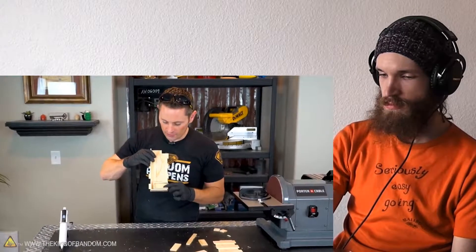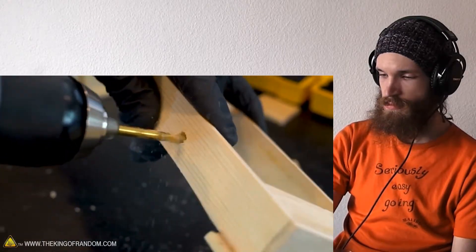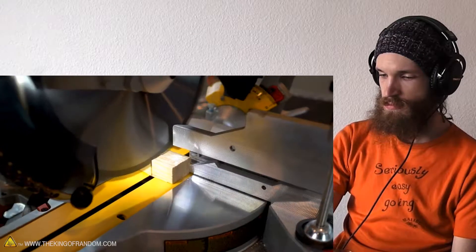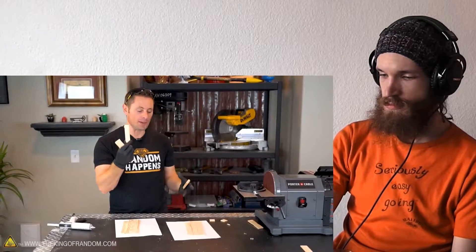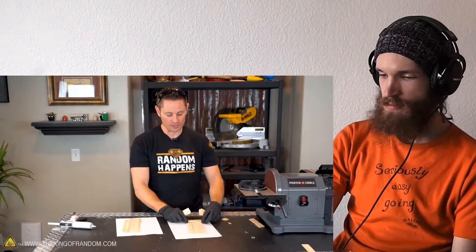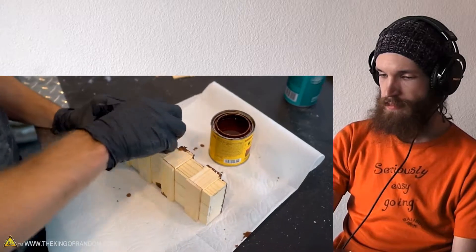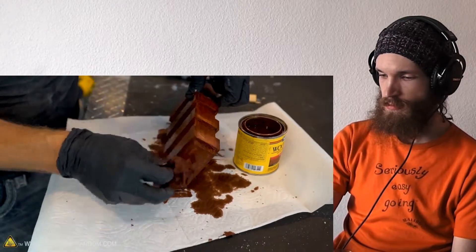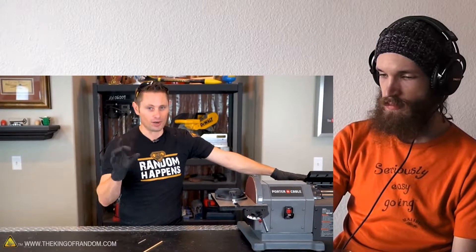It's locally designed to fit perfectly at the bottom — we want the dowel to sit right. A 3/16-inch bit seems to be about the perfect fit. These are going to be our strappings for the box and we're going to glue them into place. Sandpaper works, but a belt sander is going to make things work a lot faster and make your project look awesome.